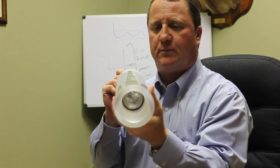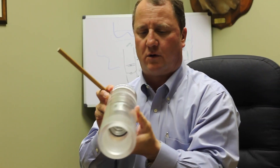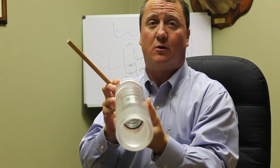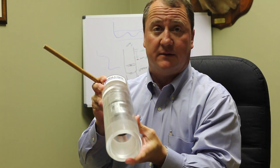The flappers are actually not completely sealed, and that allows for the other main benefit of the valve, which is that it allows you to reach your bottom hole pressure with the valve in the neutral position.